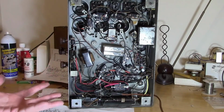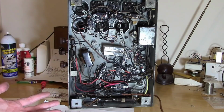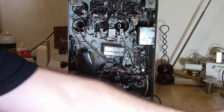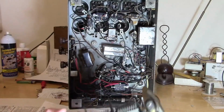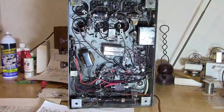And later on, radios, as we'll see, I'll be doing some more radios soon, they started getting smaller and smaller and smaller. One of them, like the tuning cap, they went from this to aluminum, which I think helped to make it not only weigh less but smaller. They put the plates closer together. Manufacturing techniques improved. Coils got much, much smaller.